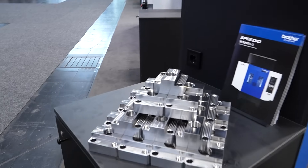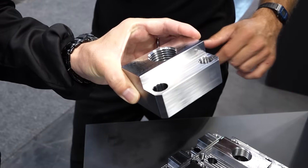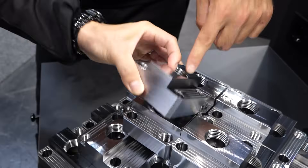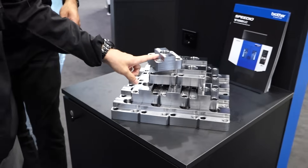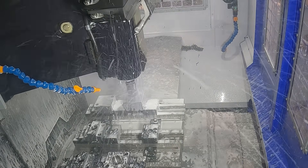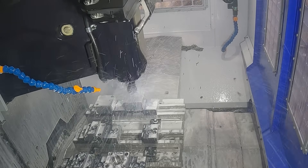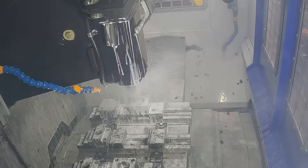So there are two very special kinds of automation here, which is something you need to consider if you want to stay competitive in machine tools. Here we've got a machining demonstration on one of your brand new machine tools. We can show carbon steel heavy duty machining — M33 tapping and diameter 50mm drilling. This is carbon steel, a real standard material for engineers. What might surprise some people is the style of a Brother machine for this kind of machining. Our machine has a BT30 spindle, which means tool changing time and positioning time is very fast, with good rigidity for the spindle. That's why we can do steel heavy milling also. You're doing the steel heavy milling on this brand new wide machine from Brother, which is new for EMO 2023.